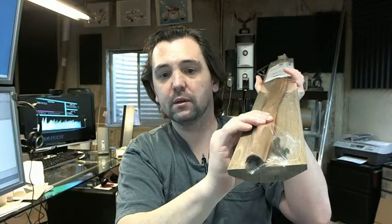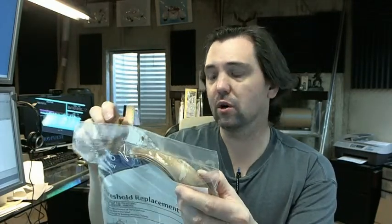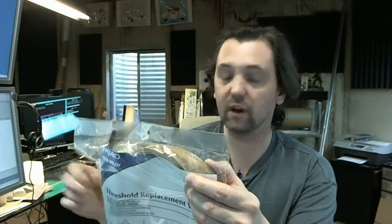You are obviously going to get one when you buy the threshold, but having this material on hand is inexpensive and it is just going to be easier to have it somewhere in the house — not in the garage if it is going to be cold, because this stuff does not like prolonged exposure to cold, it will dry out and fail. Keep it in the house and then you have got it 5 to 10 years down the road when you want to change it.